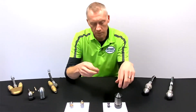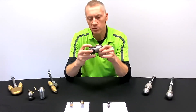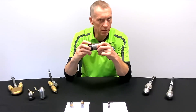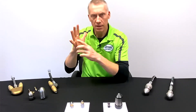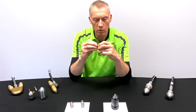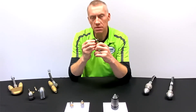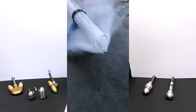The next step is what we call a controlled speed center barrel rotator. You have jets to spray out and do the cleaning, but also jets in there to brake it — to slow it down. It's been determined that if you slow down a water jet, it has more chance to dig. These we call grease hogs, especially the little ones for eighth-inch and quarter-inch lines, which really do a nice job in small kitchen lines. They sound more like a bzzzz rather than a scream, and do a real nice job on grease and light scale in indoor lines.